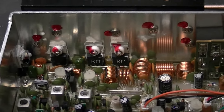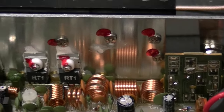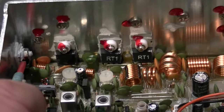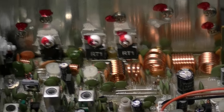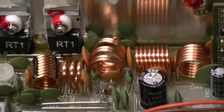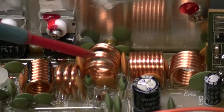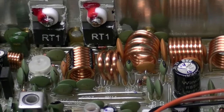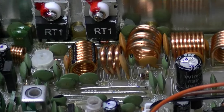On this radio we've got a pre-driver, driver, final, and then two RT-1s being used like an amplifier — that's what you've got for power. For all those guys that complain about bent coils: this is factory, hasn't been touched. These are bent from the factory because they're adjusting inductors — bending them fine-tunes the circuit. Straight out of the factory. For those who say you should never bend a coil, just wanted to point that out.